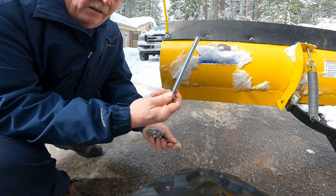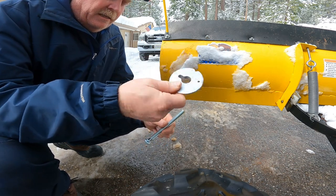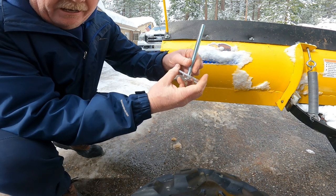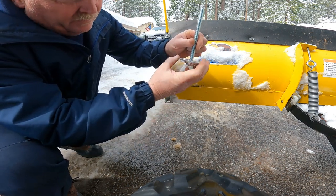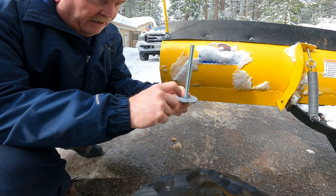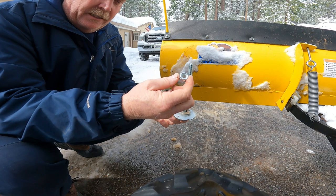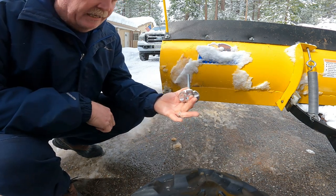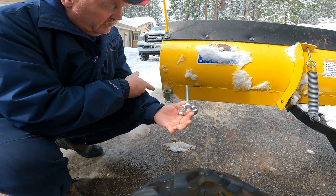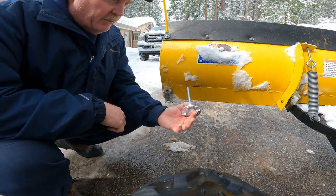What I got from the hardware store was a seven-inch carriage bolt and a mal washer — I believe this is a three-quarter mal washer. I thought that kind of looks like a skid shoe. In order to tighten this down so it stays in place, the threads don't quite go all the way down far enough, so I'm going to put three washers on there, then a locking nut with nylon in it. I'll run that down to hold everything tight, then put the rubber on the post as well and get it set with other washers to the height I want.